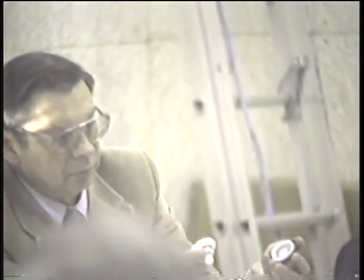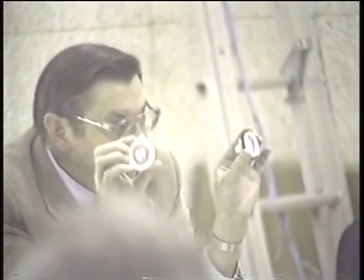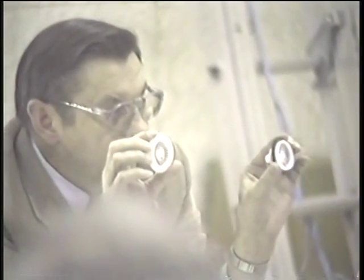But the important thing to remember is if you've got tape tension problems going in the forward direction, the first thing you look for is to see that these two are locked up in that mode, and if they are, then it has nothing to do with the slip clutches in the forward direction. You'll notice as well the silver and black signals for our motion detector, which we decided was a rotary optical type of thing. But we've had that for quite a while. So the slip clutches may be a source of problem in time. We don't know. They seem to be well protected from dust and dirt and rum and coke and whatever you may pour in there, but they're not 100% foolproof.